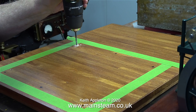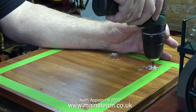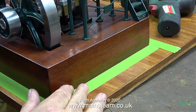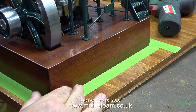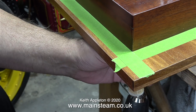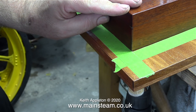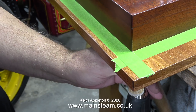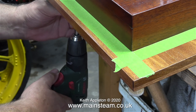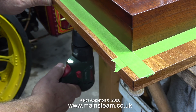I'm using my small Bosch electric drill for this and I'm being very careful that the drill does not slip and scratch the baseboard. This job is quite nerve-wracking — if I get it wrong, how do I explain to the customer 'I'm sorry, can you please make another baseboard?' Thankfully, measuring twice and drilling once, all of the holes went in exactly the right place. The drill is fitted with a screwdriver bit, but I'm not actually screwing the engine to the base at this point — I'm using the screw to mark a position on the mahogany base of the engine, after which I will drill a pilot hole because the last thing I want is for the screw to split the mahogany plinth.